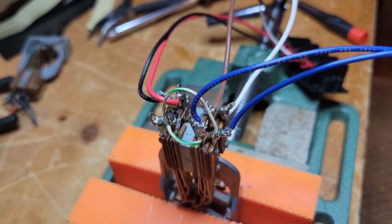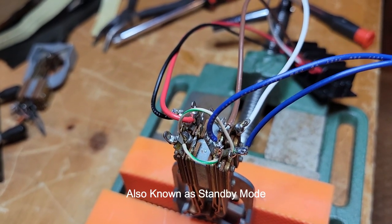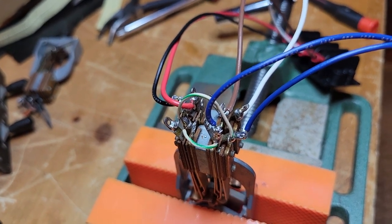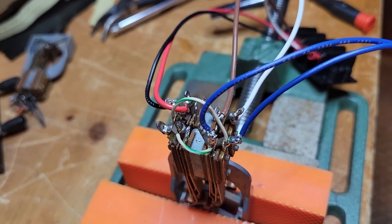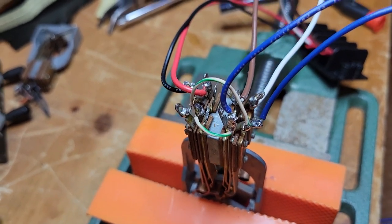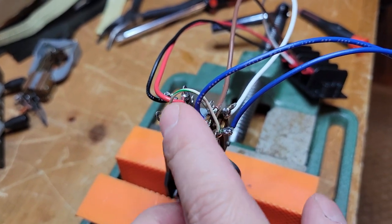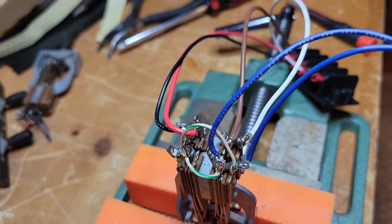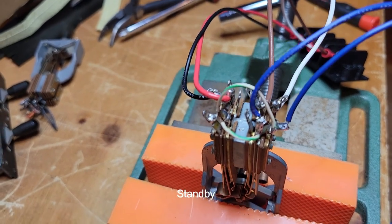And so the ST6 has a special input that is mark hold, and you trigger that, you short it when you are transmitting, to make sure that it doesn't start opening and closing if it has any audio on the receive line, right? You don't care about any audio on the receive line because you're transmitting right now. So this will force, whichever one I pick, transmitter one or transmitter two, that's why they're in parallel, either one selected will short these two blue wires and cause the ST6 to stay in mark hold mode while you're transmitting.